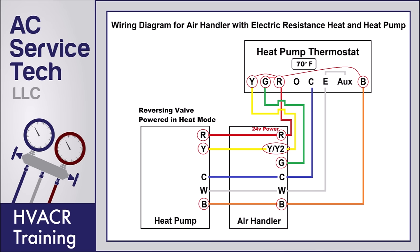If you turn the temperature up to 74 degrees when it's still reading 70 inside, the aux terminal is now going to be powered as well from R inside the heat pump thermostat. It connects 24 volts to aux, which is jumpered to E, and sends 24 volts to the indoor air handler to turn the electric resistance on. You'll also see the 24-volt signal at the outdoor heat pump on the W terminal, but it's not going to do anything there. So now you have the outdoor heat pump running in heat mode as well as the electric resistance strip heating running at the indoor air handler, both working to bring the temperature up to satisfy the 74 degrees.